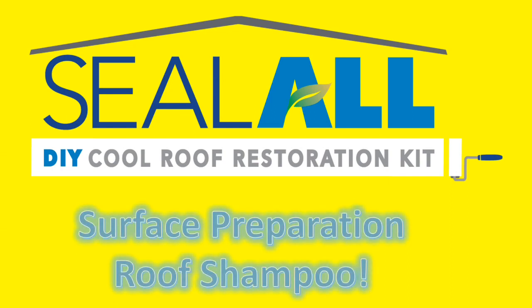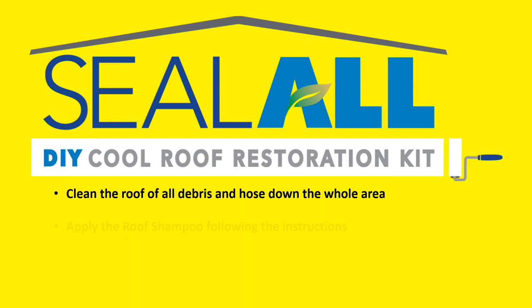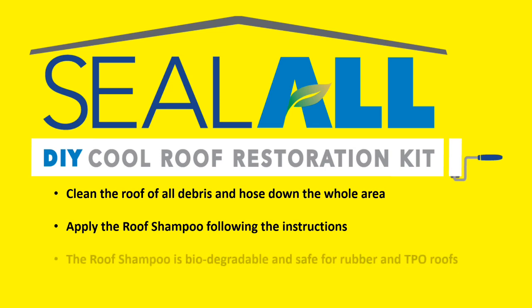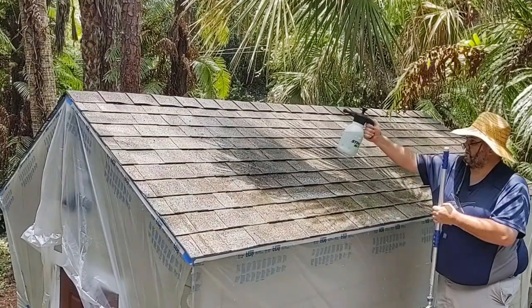First thing you need to do is the surface preparation with the roof shampoo, and it's really easy. You clean the roof of all debris and hose down the whole area. Then you apply the roof shampoo following the instructions. Basically, you apply it with any type of sprayer, and the roof shampoo is biodegradable and safe for rubber and TPO roofs, so it doesn't have any petroleum distillates. And after that you can use a brush that won't damage the roof surface.